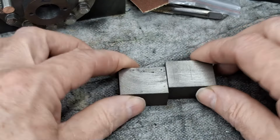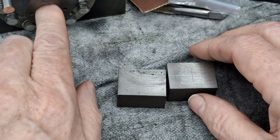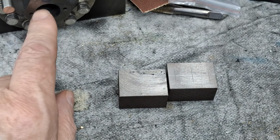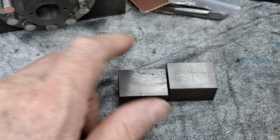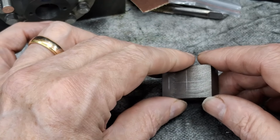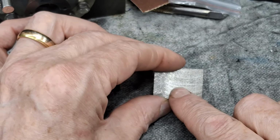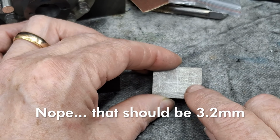So what have we got to do? Right, two items basically the same to go into that hole, and the one on the other cylinder just over there on the rear cylinder covers. And of course, between this piece and the inside of that piece, we then have a PTFE packing to make everything steam tight. Now, I've put a few scratches on this one. Can you see those? Yes, you can. So what we've got to do, we've got to drill and ream a 10mm hole through the center, just there. Two 4mm holes here.